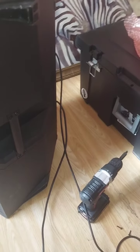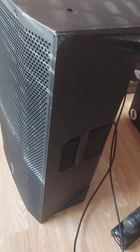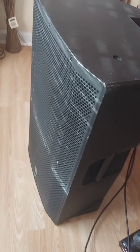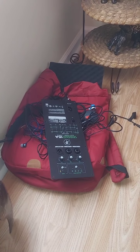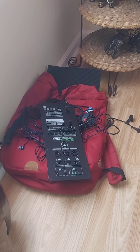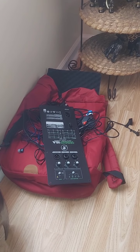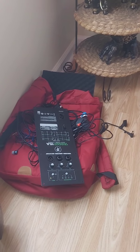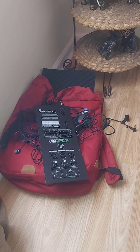What I'm gonna do is grab my other speaker and put this old module in there, to see if it plays in that one. If it does, that means something's up with the high or the sub — because it's definitely not the module, that joint is brand new.